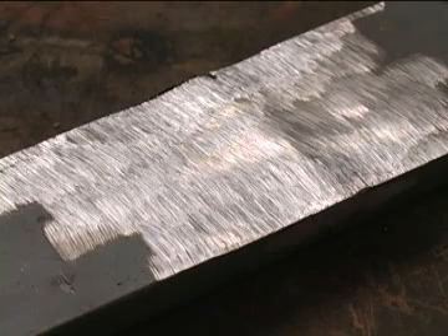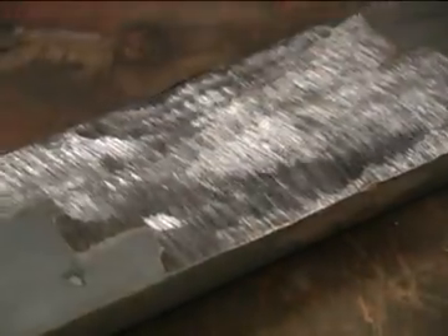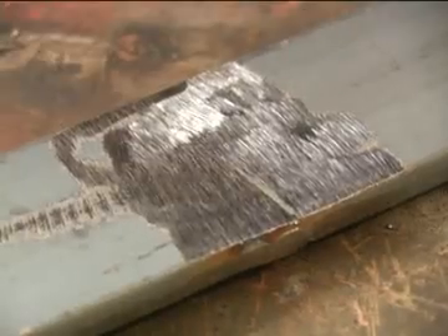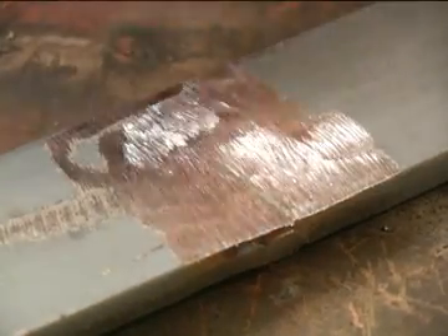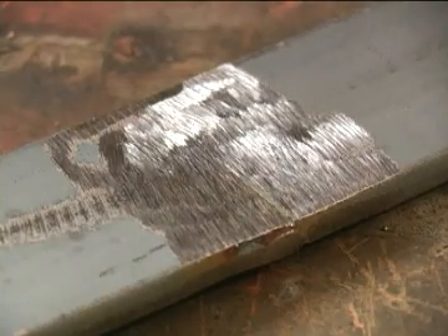And that's really all there is to using a bevel on a joint. Each bead that you lay in has to be good and solid with good penetration. I actually used a little too much heat with this job and had to grind a little off the back where the penetration came through. Just don't lose sight of your capabilities and try taking on a high stress welding job that you're not really capable of.